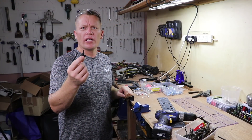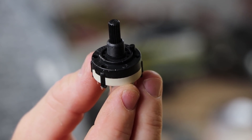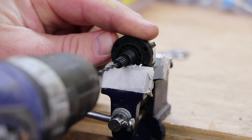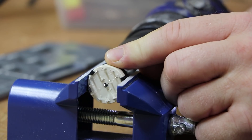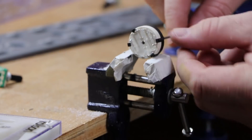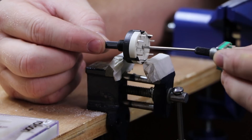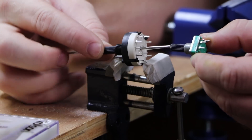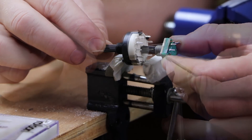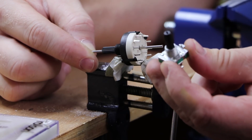The first thing to go in is the face panel — that's the 12-position rotary switch. I just need to drill a hole through the center to allow the encoder to go through. With the rotary switch now drilled all the way through, it's time to insert the two-millimeter rod. The rotary switch at this end will fit the encoder and that will screw in all the way down. Both parts need a screw thread to be able to screw the two together.